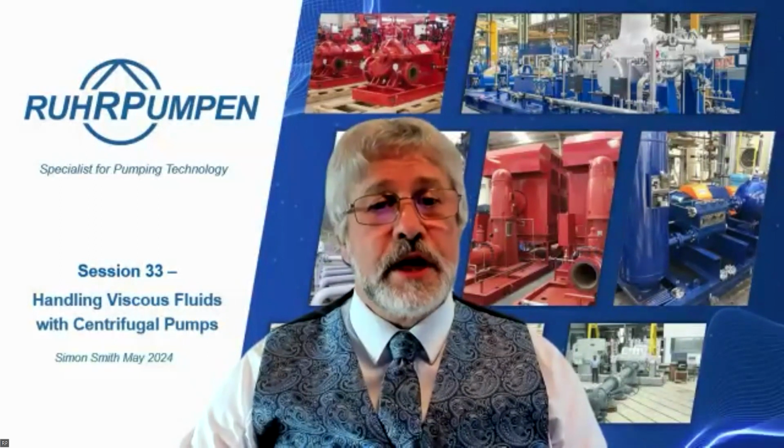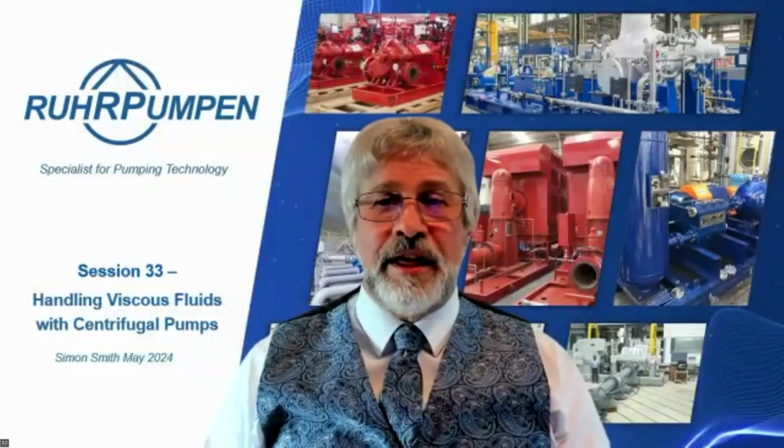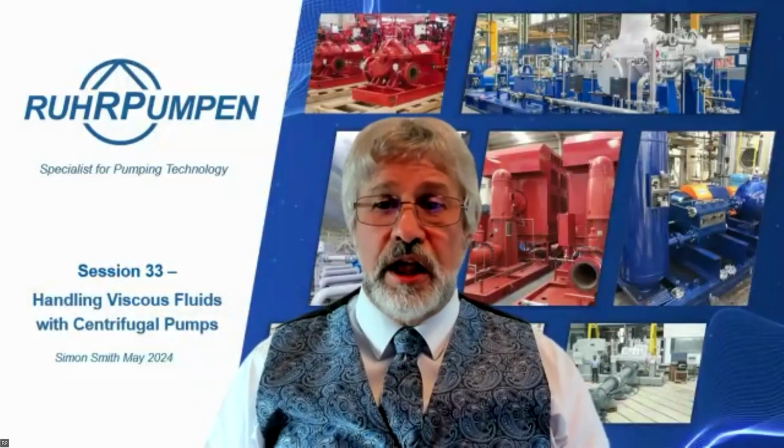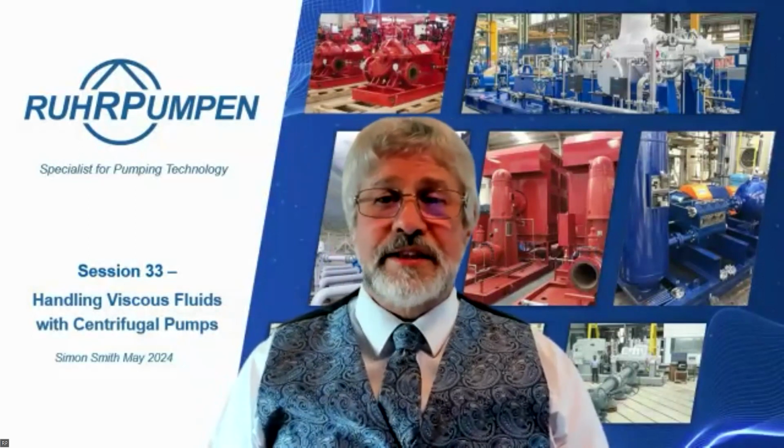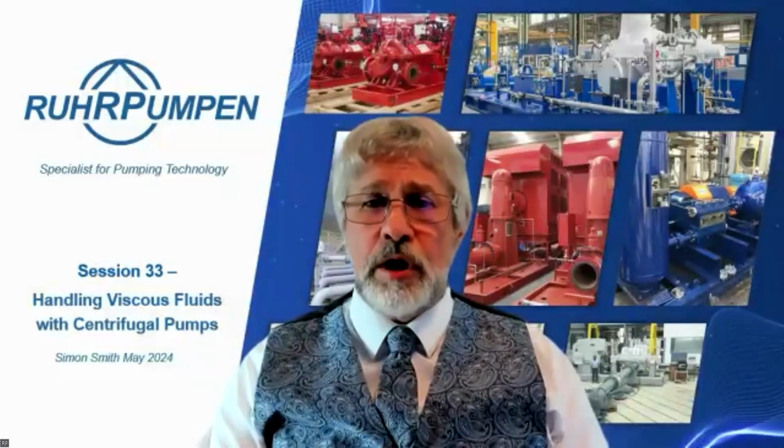Craig Butler says, how does this method vary compared with the correction charts, such as those published in Cameron's? The Cameron data actually predates the 2000 version. So, yes, Stepanoff's and Cameron's data were okay for their time, but it's been improved as time's gone by with more data.